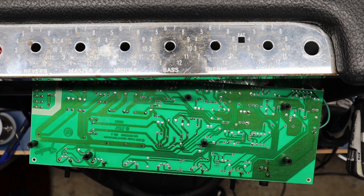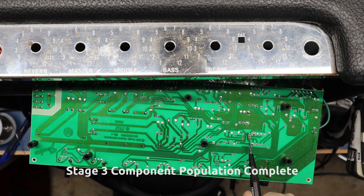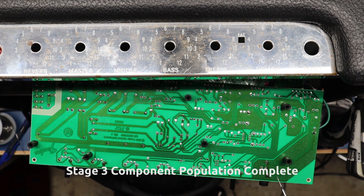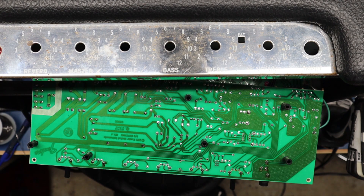Stage three is finished. The op-amp has been changed out and the feedback resistor in the return loop — R44 — has been changed to a 120K. The new op-amp is an NJM4556, a dual high-current op-amp. I'll put that part number in the description. Here is the finished back side of the board. I'll clean up this flux, then get it buttoned back up and show you what it looks like from the other side.